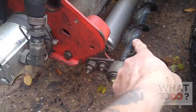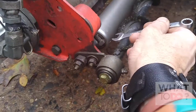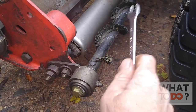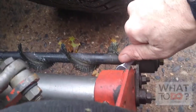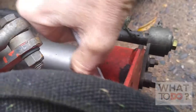I normally leave the reel running, but it's very unsafe because you have parts spinning so close to the bolt. It is a moving part and you should not have your hands there. I do it all the time, but that's me and my own hands. To be safe, you can adjust while it's off. We are going to loosen the bottom with a three-eighths, then do a small nudge on the top, and go over to do the same thing on the other side.